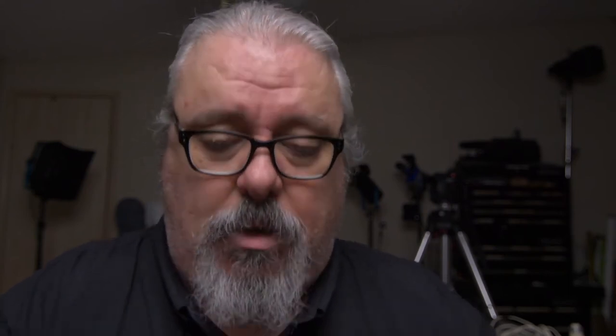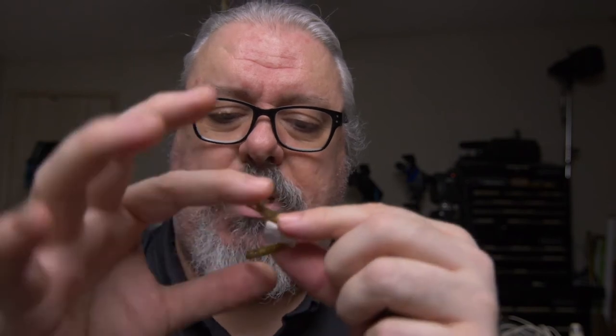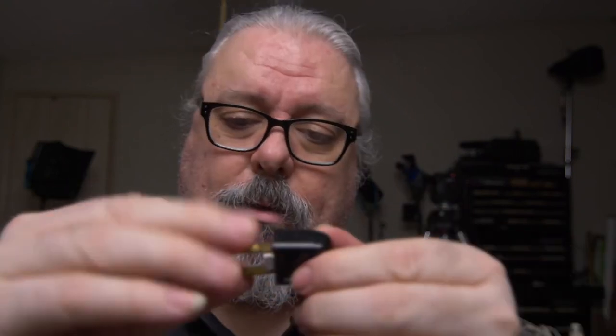Here is what we call a male add-a-tap. It comes apart — you just pinch it and pull the internals apart. You insert some lamp cord in here, squeeze the two pins together, and it knifes in and makes electrical contact. First you thread it through the protective jacket, then crimp it down and draw the whole thing together. That's your male add-a-tap.